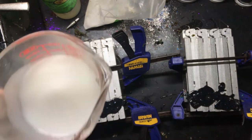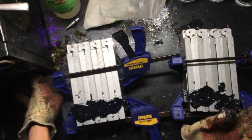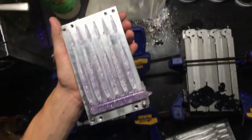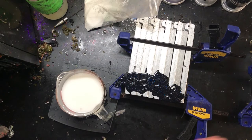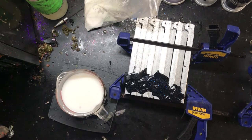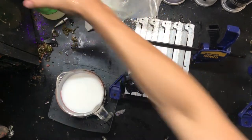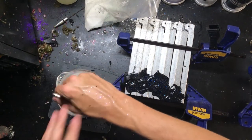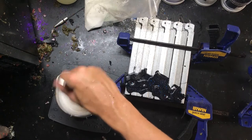Now I've got another cup of just clear set up. Here's the other mold for the clear with silver, black, and purple — some super cool looking baits. So I've been working for about an hour and I've got a good amount done. I've done a bunch of black and blue and knocked out a bunch of the clear with different glitter colors. So now I'm going to do a little bit more pearl — specifically pearl wikiworms. I've got my pearl colorant — it might have been a little much, but it won't really matter. Heat stabilizer gets in there, give that a stir. This is two measuring cups, because I want to be able to do all six wikiworm molds with one go.